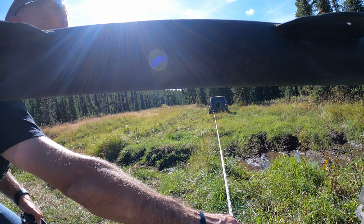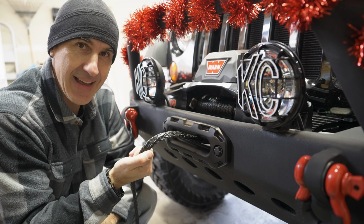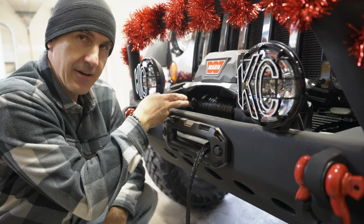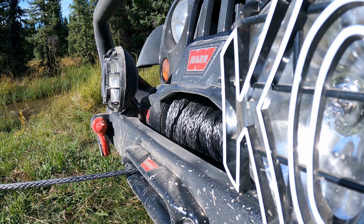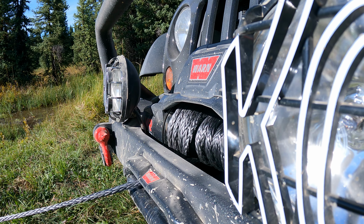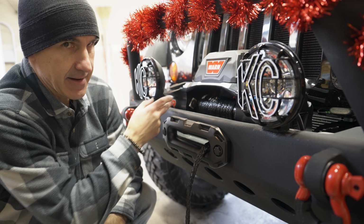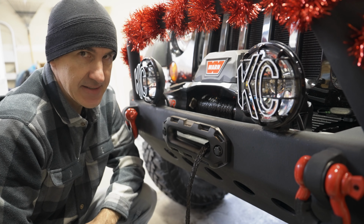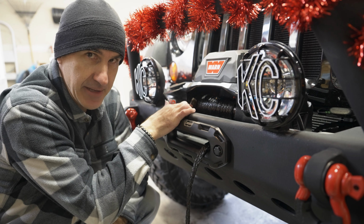So what secures your winch line to the drum, which is the part of the winch that rotates, is this retaining bolt. Now, that bolt basically gets exposed to a lot of moisture, through your line that could be damp. So it corrodes pretty easily, and it's often overlooked. When your winch is all spooled up, you don't see it. So it's kind of like out of sight, out of mind, but it can break super easily. So be sure to check that retaining bolt, and under no circumstances should you use your winch unless this retaining bolt is actually in place.